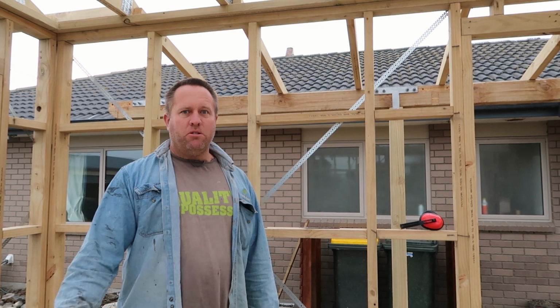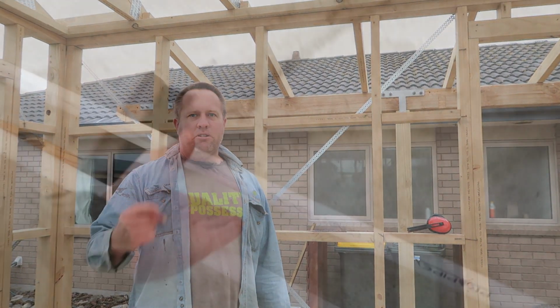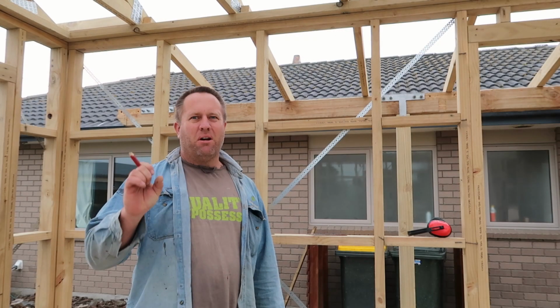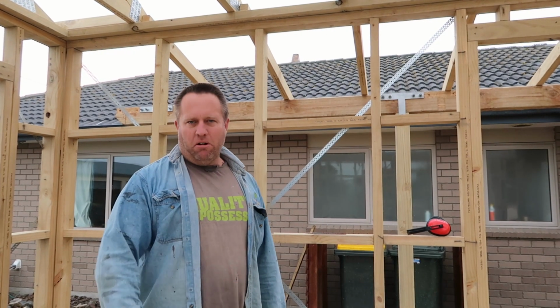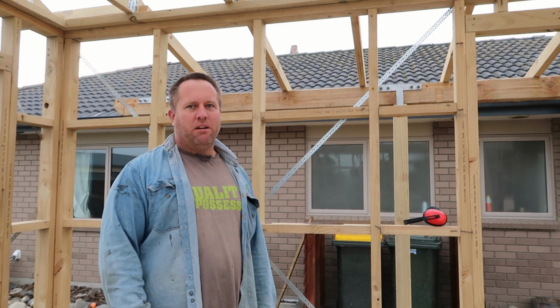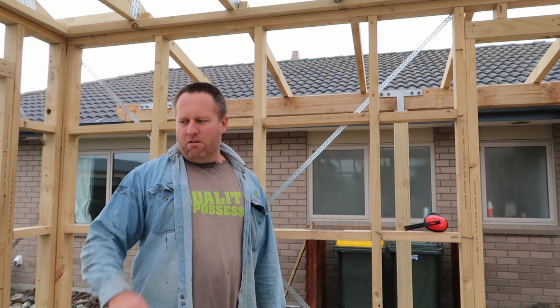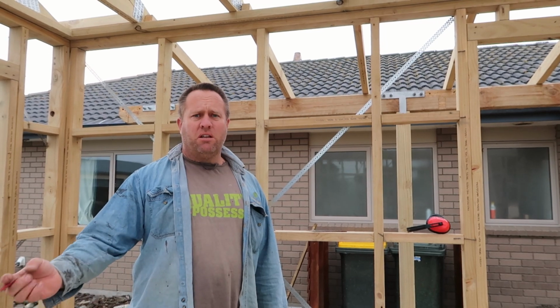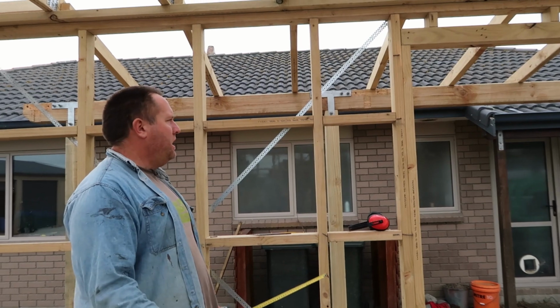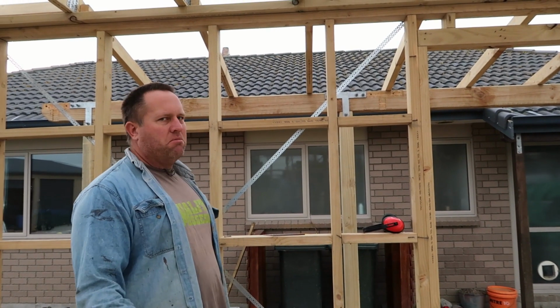I'll actually prefer to use solid, because then if you're using it on cooling a lot, quite often flexi drain will actually get moldy and block up, and then you just can't get rid of it. So I like to use solid, so if I have to come back a year or two later, I can blow it out and it's easily done. And plus there's no ridges in what I use, so it doesn't seem to grow in there. So if it was a bigger heat pump, it would be about 900 to a metre long.